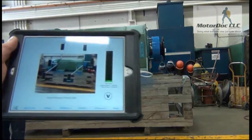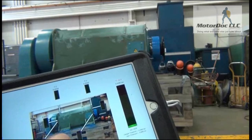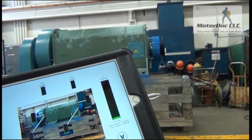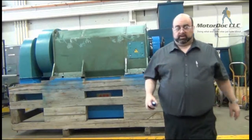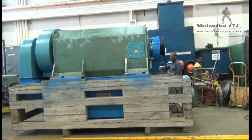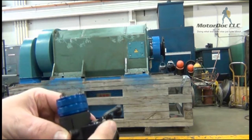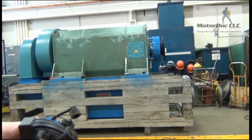I'll note that for the sake of demonstration purposes, I'm not necessarily in the spot that I'd prefer. Here's my velocity and here's my acceleration — velocity is very low in the axial. All I have left is verticals. This unit here — as you can see, the Bluetooth is on; press it to turn it back off. That's the temperature probe right here that can be attached to it, and I can also attach a lot of other instruments to this particular point.